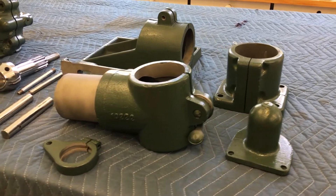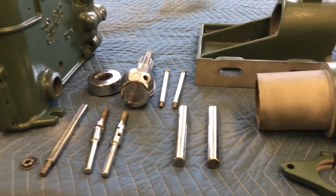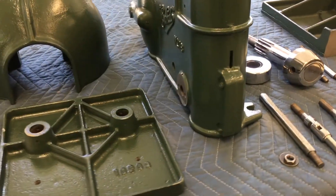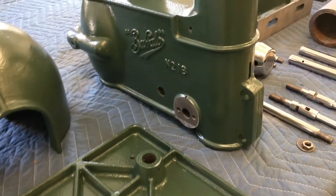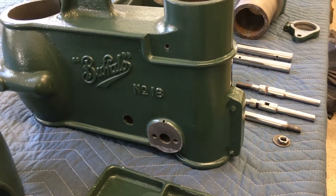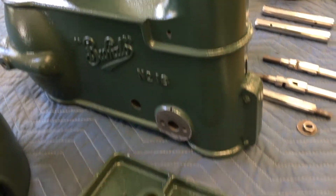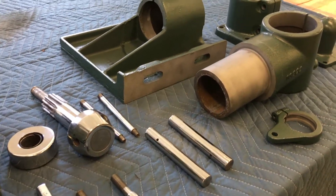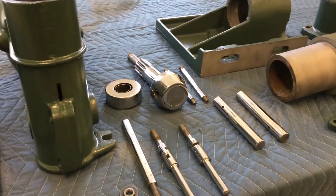The painted parts are now painted. The brightwork is now bright. We're going to get ready to put everything back together. All the bolts have been cleaned up, the paint's cured, it's ready to go back together. I am going to letter that probably in a little bit of an off-white — I'll wait until it's all back together to do that. I still have to go in and clean up the surfaces for the bearings and the mating parts. It's going to be a little bit easier to do that when everything's mounted on the pole again. I got the pole clean and the base came out real nice as well.